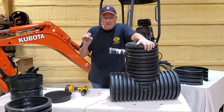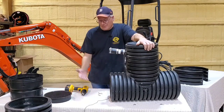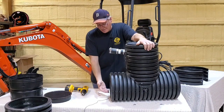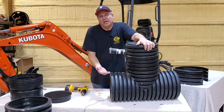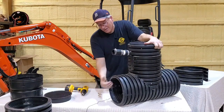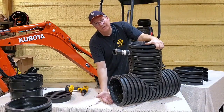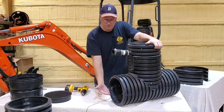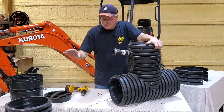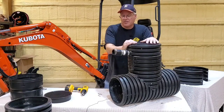You want on-site storage, especially in the south. The longer the chamber, the more water you can hold. Say the power's out, you're on vacation. Well, the switch is gonna click and the pump ain't gonna run with no electricity. But this entire chamber can fill, okay? It's not gonna turn on right here and then pump it down. That's not gonna happen if there's no power. You got a power outage, it's gonna allow the water to fill this entire chamber, which is bonus. So add some chamber length for some on-site storage in the event you have a power outage.